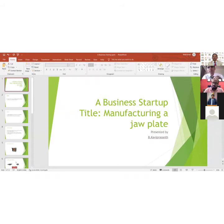So, for example, sir, if the material scrap rate is 42 rupees a kilo, you have to put it through melting, molding, fettling, dispatch. It comes to 85 rupees. So if you distribute at 88 rupees, we can gain 3 rupees. So according to the different patterns, they have a different rate, sir. For example, if you take a side plate, sir, it's going around 90,000 for 1 ton.